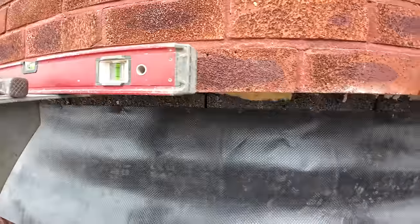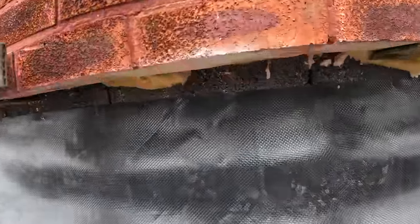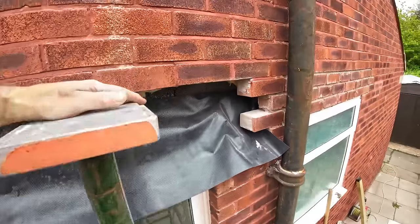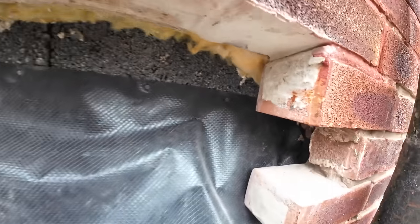This tray's in. You can see it's nicely nailed flat against that block work. Nice block work, that, for a change. It doesn't usually look like that inside the cavity. So this is secure. I'm not even going to bother with silicone on that, because there's no sticky out bits on it. And the only bit we're going to put silicone is on the top in these corners where we can't get in with the nails.